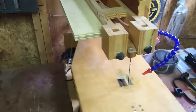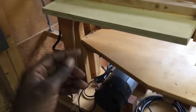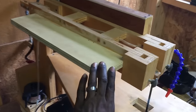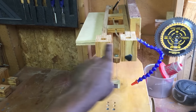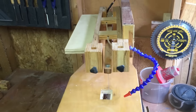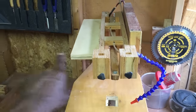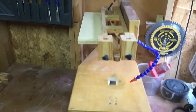I'll quickly tell you about the other changes — you'll have to watch the video for full details. This blower comes from an air mattress pump; I no longer have that air mattress but it really puts out a lot of air, so that powers my dust blower. I've also added a component that increases the depth horizontally of the top section. I had vibration at higher speeds, but by increasing the depth in the direction of vibration it actually quieted the top section down so it doesn't vibrate as much.